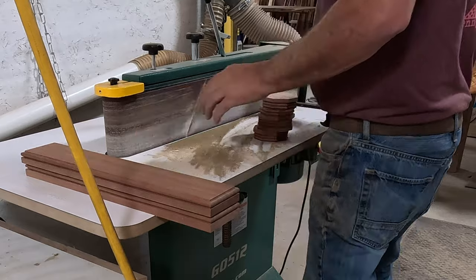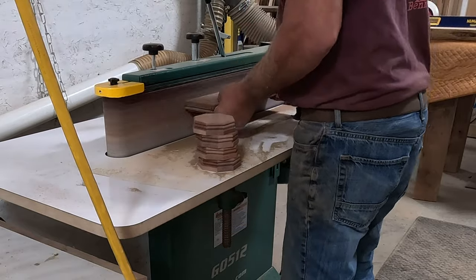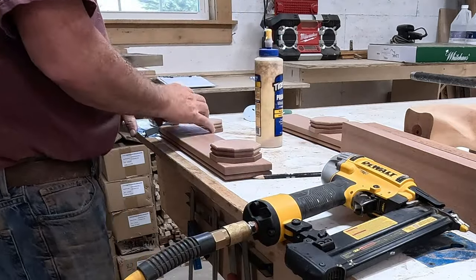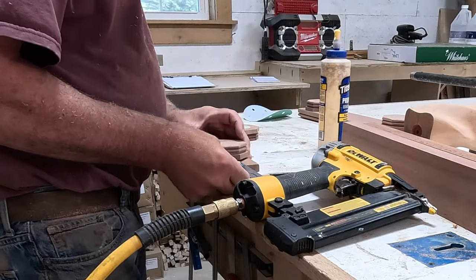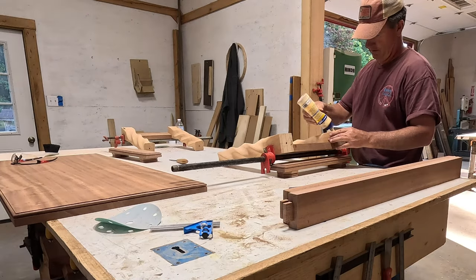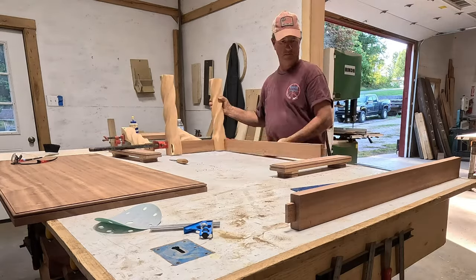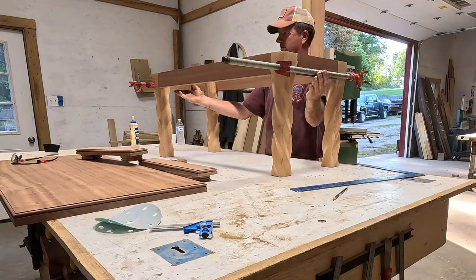I've never learned this little thing that happens for some reason, but I'll put a couple pieces of wood on top of the sander and start sanding, and there they go — they all end up on the floor. One of these days I'll learn. Once we get all the pieces sanded, I remember the days of watching Norm Abram with a nail gun and a bunch of wood in his shop up in Massachusetts. He did a lot with a nail gun, and this kind of reminded me of that — just a Norm Abram shot of nail gun, wood glue, and some wood. This is all it takes — a couple little nails on here, because we're going to end up putting screws all the way up through both of them right into the leg. I've already dry fitted everything, I know it's all going to fit. Putting the glue in the mortises — I don't get too carried away making sure I got glue all over each tenon. I try to not have squeeze out, so I'm trying not to put the glue too close to the cheek of the apron. Otherwise you're going in there and cleaning that all out.